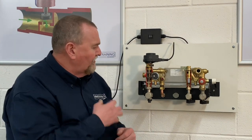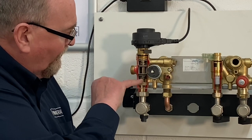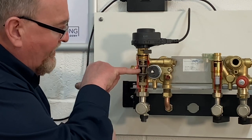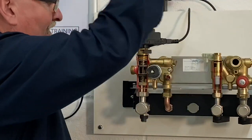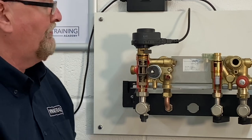I've got it on a little block. At the moment this one is open to the heating position, so water can come down and go around the radiators. It comes down from the main heat exchanger into this chamber, then down round the radiators, comes back up through the pump manifold, and back to the main heat exchanger.